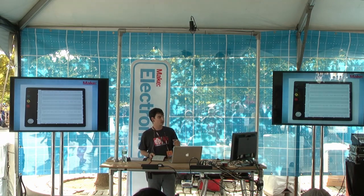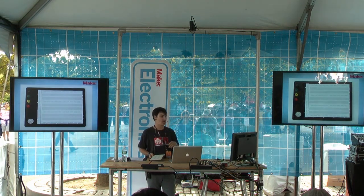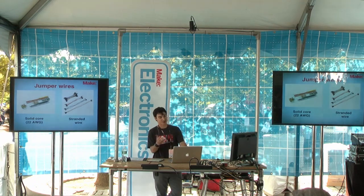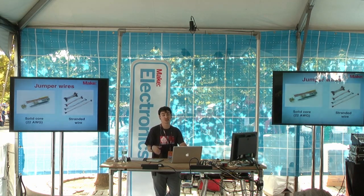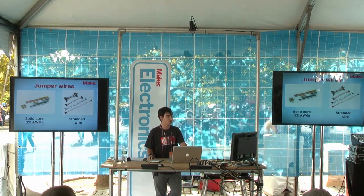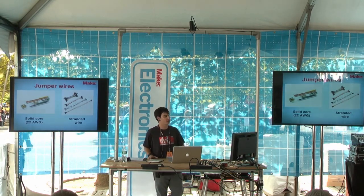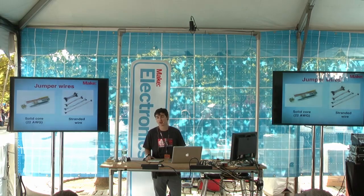Also in this example, on the left-hand side going vertical, you can see another power bus — it works the same way as the power strips on the upper side of the board, just more flexibility for how you want to wire things up. As for jumper wires, I honestly prefer the stranded because they're easier to work with, but they do make a bigger mess. A great thing to know is that solid core is usually 22 gauge — a really easy gauge to use. You can make your own jumper wires or buy them in packs for around $10; they come color coded and cut to certain lengths. Or you can grab your own color of solid core wire, strip about a quarter inch so the bare metal is exposed, bend at 90 degrees with needle-nose pliers, and you have your own jumper wires.